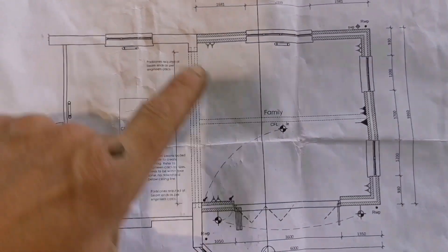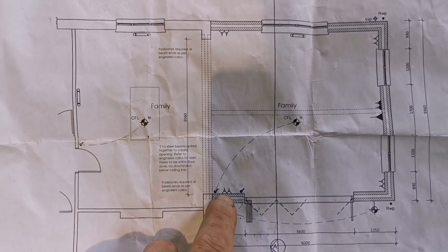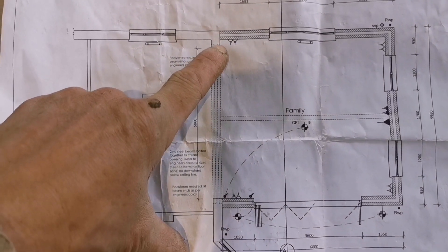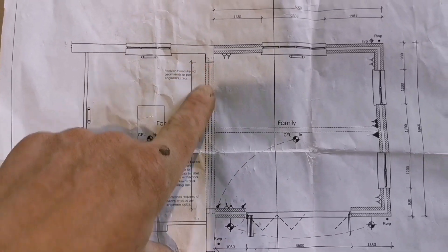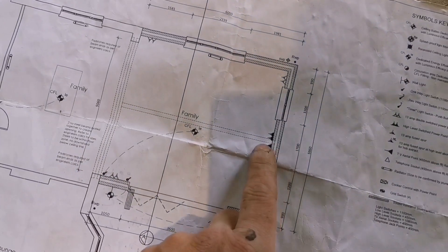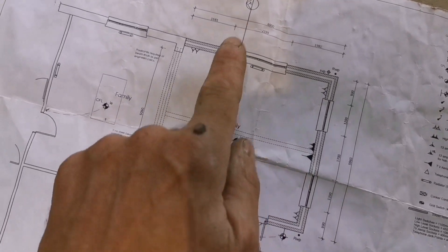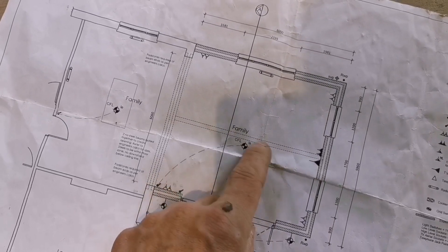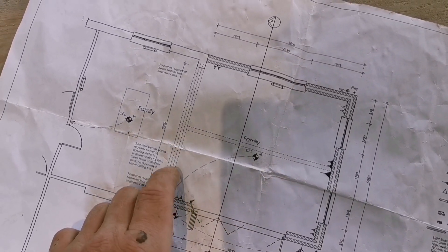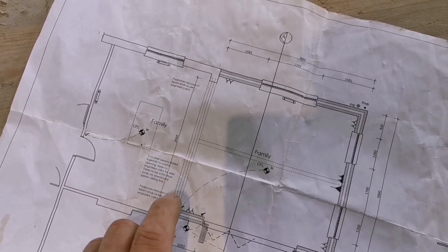So this is what we're doing today. This is the opening — this is the extension that we're building and this is what it's getting opened up into. We're going to come back here through that wall, so that's going to be 150 back, and then we've got a little nib on this side. Two steels bolted together, and then one across bolted into a padstone on the other end. Joists will run in between all them like that to floor it. We'll get some holes drilled in that piece of wood so we can bolt the steel to it, and these can all be bolted together.